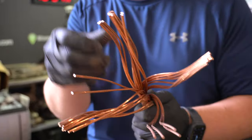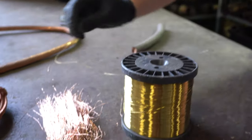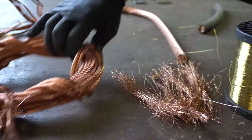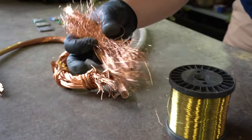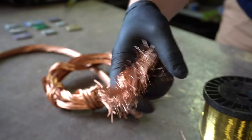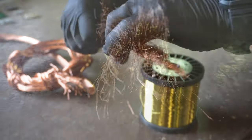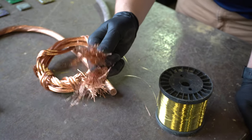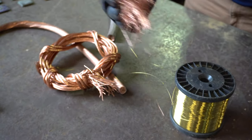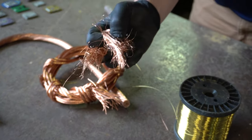Sometimes when this gets too hot, the rubber could melt, go inside, and that will lower your price. Now you're going to ask the question of different hair wire. You can look at these different grades of wire and these different thicknesses, and obviously see that this is much thinner. This is called number one hair wire and is almost never bought as a bare bright — it should not be, for multiple reasons. One, a lot of these pieces of hair wire are actually out of electric motors. They look like they're stripped copper wire until you put them next to real copper stripped wire, and you see that they have a reddish hue, a pink hue — that's not copper. That means there's an enamel on it, and that makes it become a number two.